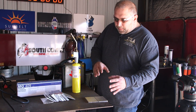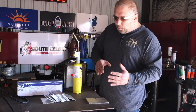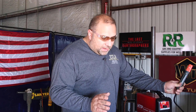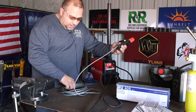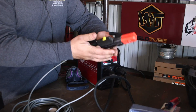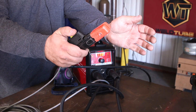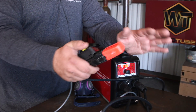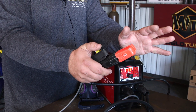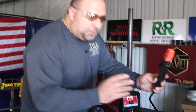A little bit of temperature control on your welding machine, like a hot start option, may help you. What I've done with my machine is I utilized one of those TIG remote controls — it plugs right into the front of the machine and ultimately I'll be able, while welding, to control my heat with my thumb. I can do a hot start, slow it down if there's enough heat in the material, or if the fit-up is not perfect I can fill the crater. This helps me control heat input rather than committing to a preset amperage.